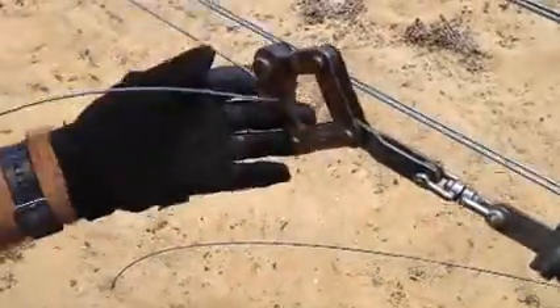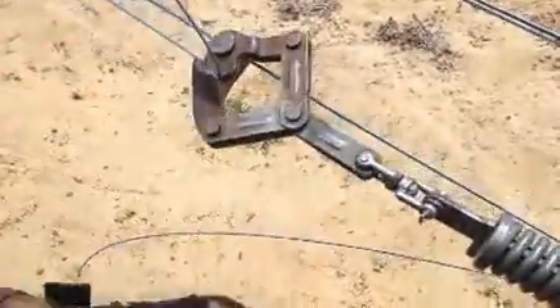Today we're going to show you how to do a Texas Brown knot on an end assembly, the good country fencing way. This wire here that comes through the jaws — you might cut it back here about where these jaws are. Bend it out 90 degrees to the jaws, tilt them upright if you like.